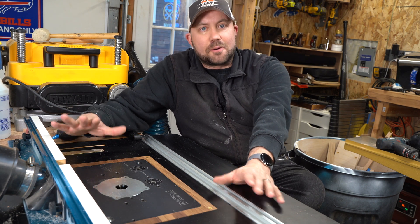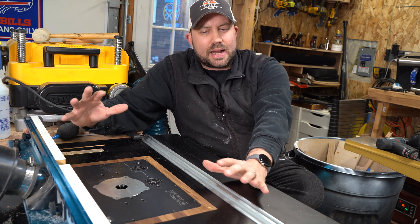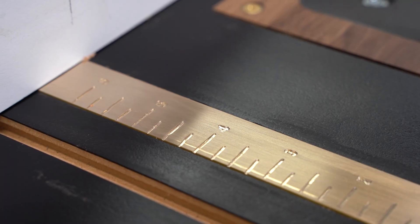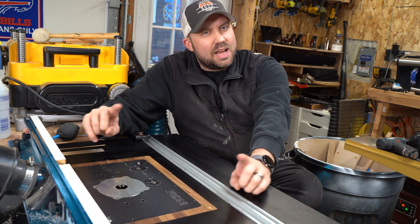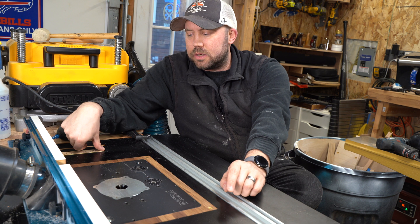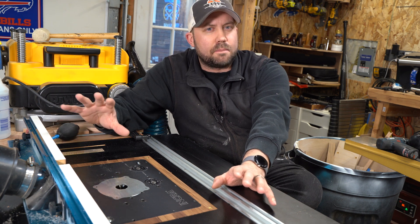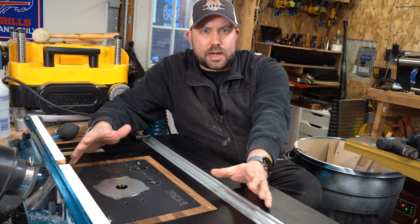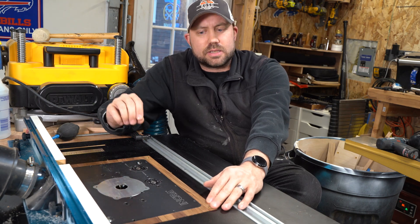The router table upgrade is done and I'm really happy with how it turned out. This was something in the shop I was kind of ignoring — I didn't like the look of it or the function of it. Adding these brass measuring inlaid bars is hugely beneficial because I can align the fence really easily to my bit. If you noticed the inches don't actually match the depth of the router bit, that's okay — the biggest thing was that the inches are parallel from bar to bar, so I can set up my fence. I don't care if it's one, two, or three inches — what matters is that they're parallel so I can square the fence easily to my bit. The inlaid walnut is totally aesthetic but it looks nice and it fixes the mistake that was there before.